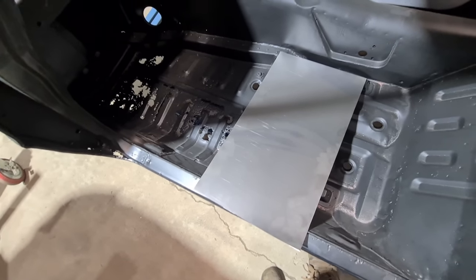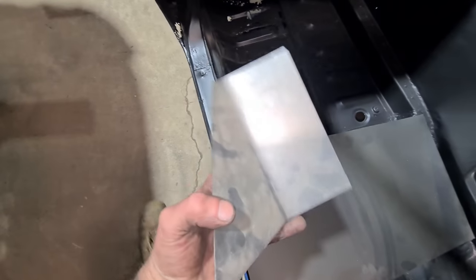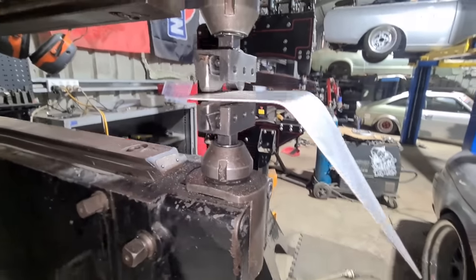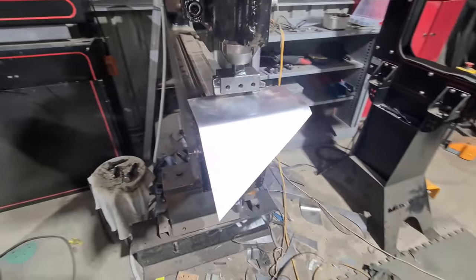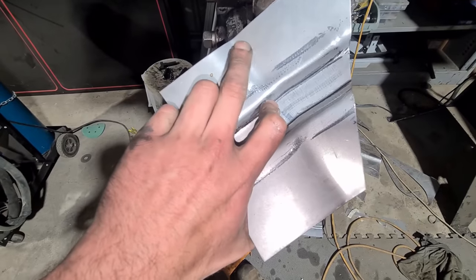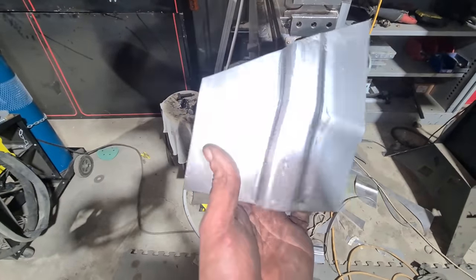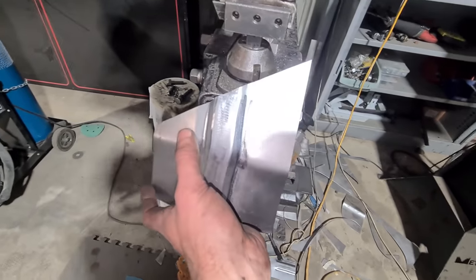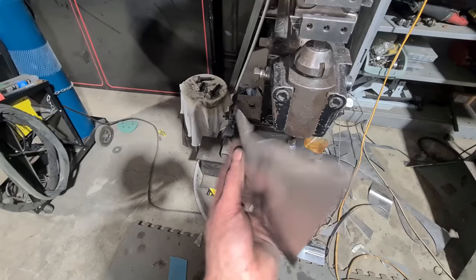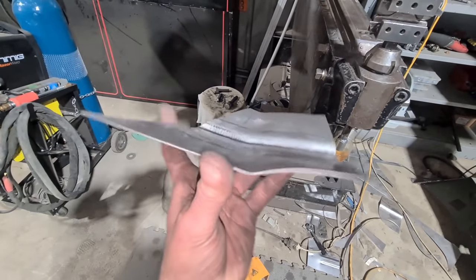I bent some rough scrap just to see what it does if I try to drive over the fold. As expected, it just straightened it out — it's not really enjoying it, just wanting to force this back straight. I think I'll just run it straight and cut a slit, bend it to where I want, and tack it back up. Otherwise I'll be fighting too much with the in-between areas — it'll just be quicker to cut and tack.